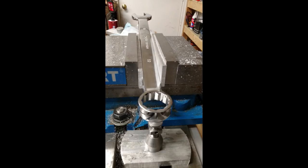You could also easily use copper sheet for this, or even a heavy card stock like the back of a paper notepad. This is also a really handy technique to use if you've got a lot of pieces that are similar but not exactly the same thickness. Put something in there that's a little bit crushable and you can hold them without having pieces flying out of your vise.